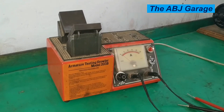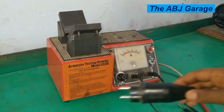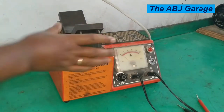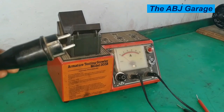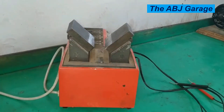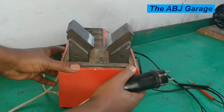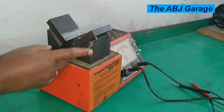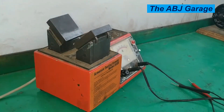The growler tester is basically a large electromagnet — I can say it is a large transformer that is powered by AC. As you can see, we have this plug which will power a very large electromagnetic winding. The electromagnetic winding poles are connected here, so this will become one magnetic end and this will become another magnetic end. Because it is being supplied by an AC current, alternating magnetic flux will be generated on these magnetic poles. The magnetic poles are V-shaped so that they can allow sitting of the armature on the growler tester. The magnetic field alternates — north, south, north, south — that is why we call it an alternating magnetic flux.